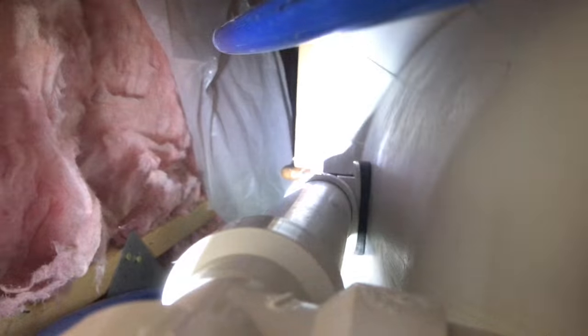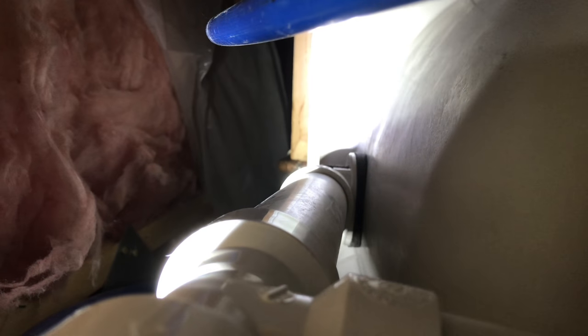It looks like it had been leaking in a couple of spots. But while I was looking at it, I thought under the tub right where that seal is, it may have been leaking a little. It looks like it's leaking from up and under. You see up there, there's a gasket — it goes to the stopper in the tub. Inside the tub there's no silicone on top sealing the stopper; there's a black gasket there you can see. I'm going to go up there and take a look because I can see the water line coming from that black gasket, and see if we should put some silicone on it to stop the leak.